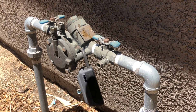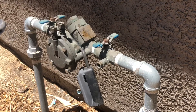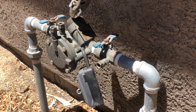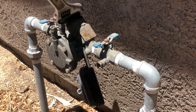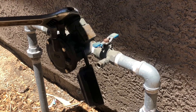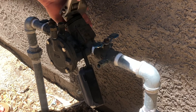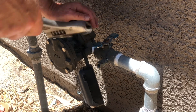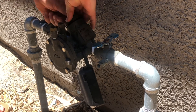I'm going to turn off the water so now that backflow preventer is really isolated — I've got the water off on the right and the water off on the left; the water comes from the right and goes to the left. I'm going to take that cap off right there. Now this is spring loaded, so as I feel it coming closer to that cap coming off I'm going to cover it up so the spring doesn't cause parts to go flying. If you just kind of put your hand on it like I'm doing, those parts will stay together so I can see how they come apart and put it back together correctly.